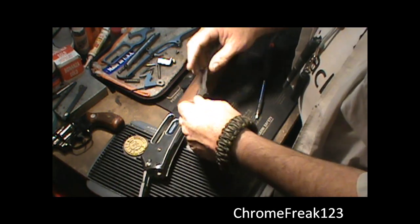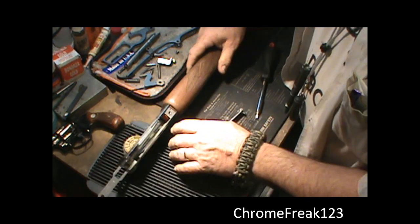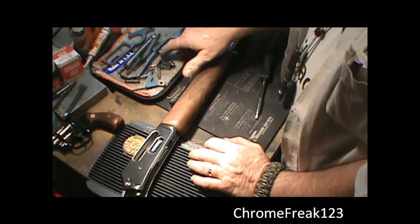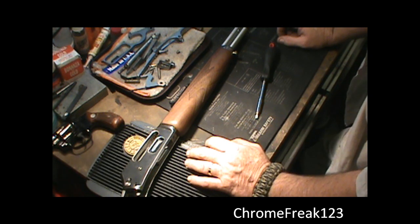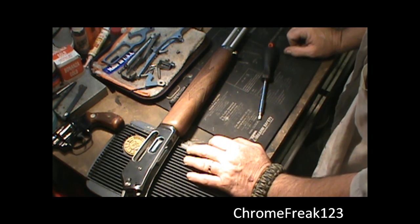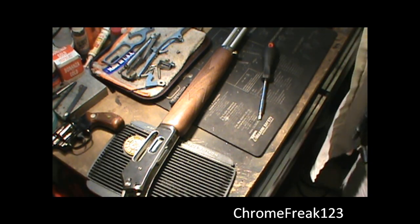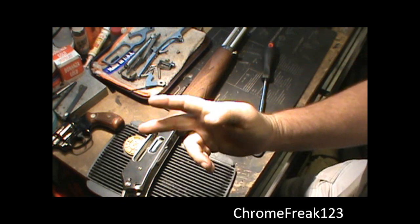That's it — your work and action come right out. That's everything. I'm not going to take the safety out — there's no need to take that out at all. I'm not going to mess with the magazine or the forehand, there's no need to. I'm going to do a trigger job and everything I need is already out. I'm just going to completely smooth up this action — all the machine marks in there — get everything smoothed out. I'll be back with the reassembly of this 1895 in 45-70. Most of the Marlins lever actions are going to be taken down the same exact way. All right guys, thanks for watching — Chrome Freak 123, K&W Gunworks, Southern Yankee Guns, Ammunition Depot. Peace.